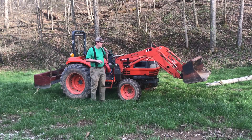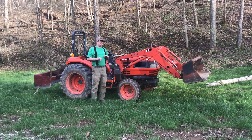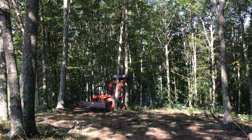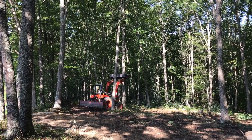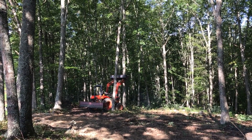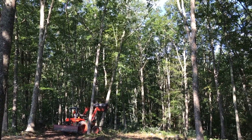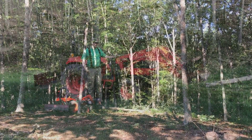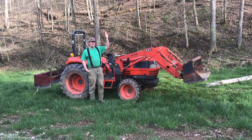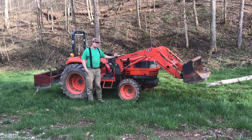The bucket can actually be used as a tree-felling assistant — again, not my number one recommendation. In the footage you're seeing here, my dad talked me into letting him use the tractor this way; I wasn't too crazy about it. It kind of sounds logical and looks good on paper, but bad wind or anything can cause the tree to kick back. We did use it to push the tree over as I started it falling to make sure it was going the right direction, but it's not something I'd typically recommend.